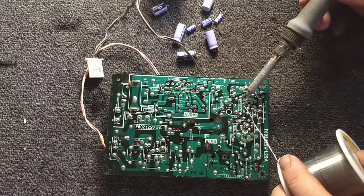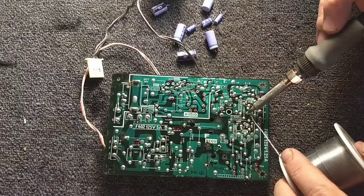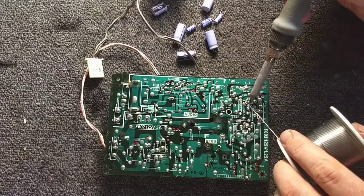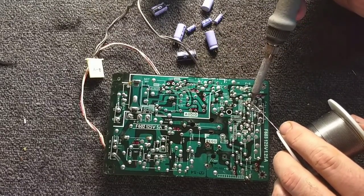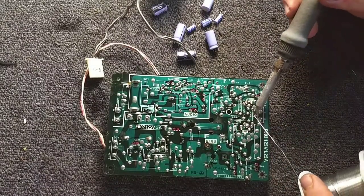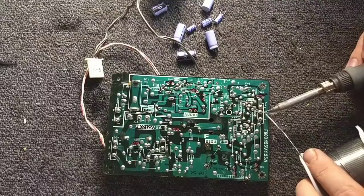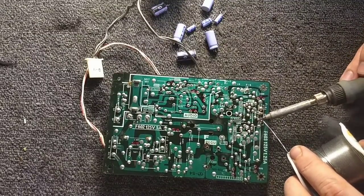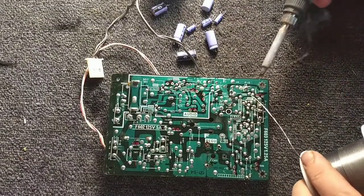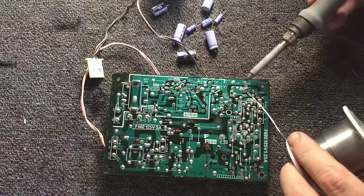B voltage adjustment. I like how they label everything on the boards. It's just so nice. Really touchy soldering on this driver transistor for the regulator. Remember how we could just smack it and it would do weird stuff? So we're more or less going to have to resolder all of these boards, because I can just see just about every connection here on the board. The camera really doesn't reveal it all that well. It has a nice crystallized solder on it, which pretty much means it's going to fail once it heats up. Let's go.